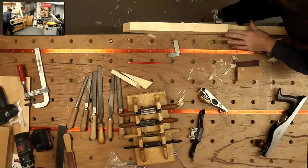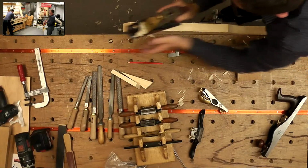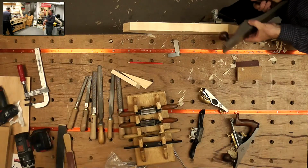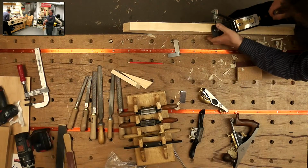And all we want to do on this is get this back to flat. Now I'm doing the nice easy task at the moment. I think Craig's going to creep in now. I'm going to go low angle plane for a minute. This is giant block plane. We're cutting down for end grain fibres. Got to remember to take my magnet off, which is my blade guard.